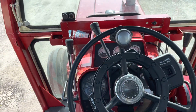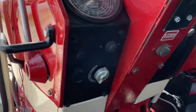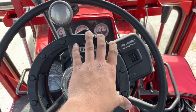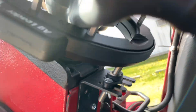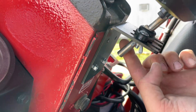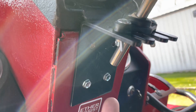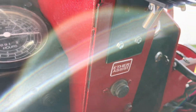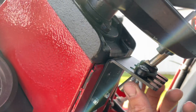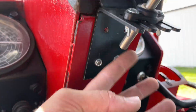This whole process from start to finish took maybe two hours and then we spent 30 minutes calibrating it — it was fast. The thing that took the longest is that the 1066, or the 66 series, does not have a kit ready to fit — it starts with the 86 series. We had to get a little creative for stabilizing the wheel. This comes with the kit but it comes out and down. All we did was cut that off and put some self-tappers. We took this plate off to make sure we weren't going to hit anything on the inside of the steering column, which we weren't. We just used some short self-tappers and were able to put that right there. All we needed was a grinder in about 10 seconds with a cutoff wheel and it fits perfectly.